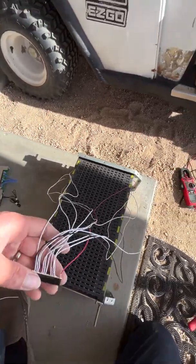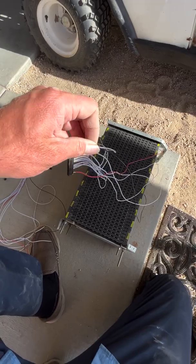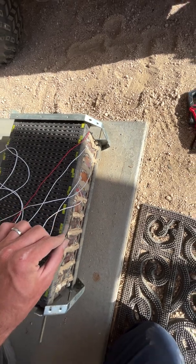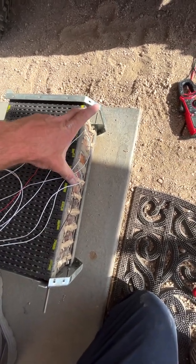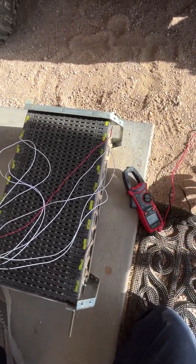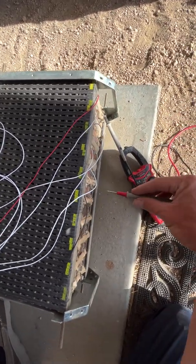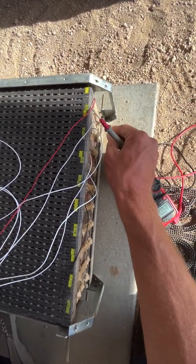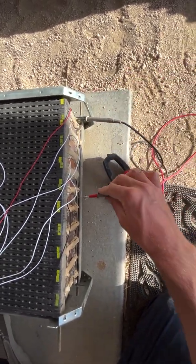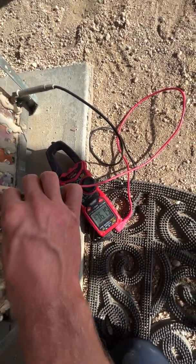You work your way all the way down. A good way to check and make sure is — from that positive, all the way to where you have one connection here, it's going to be a negative readout. You should get half of the 20S pack voltage if you read across here. Not sure it's strictly necessary to confirm, but we're going to do it just because. And there we are — we got 36 volts here and our pack is at 72 volts.